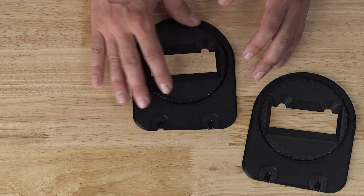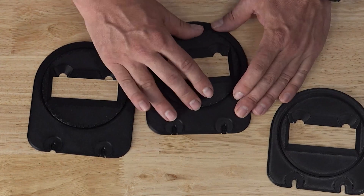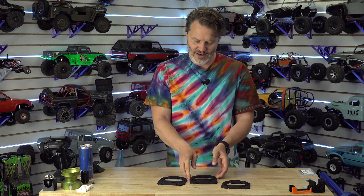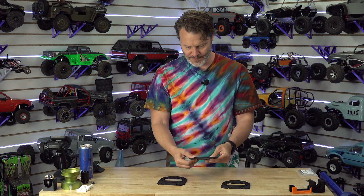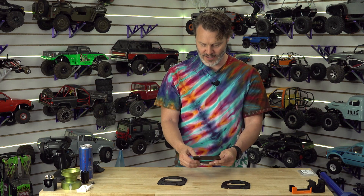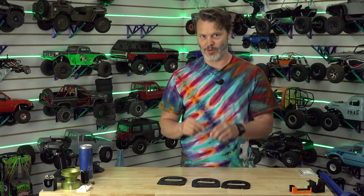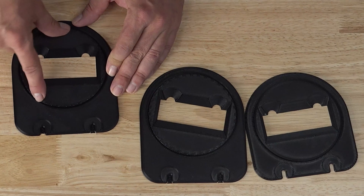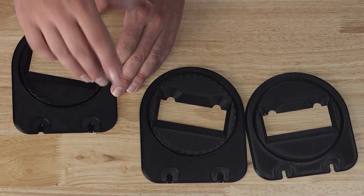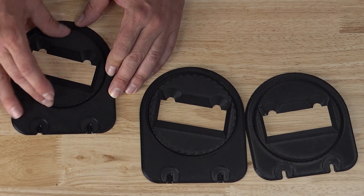They seem to fit real nice, at least, and they're not moving around. The first one didn't quite reach far enough. The second one reaches far enough, but I screwed up my tolerances — there were too many polys in the STL and that messed things up. Actually, I messed up the dimensions myself; I just didn't have everything smart dimensioned in SolidWorks, so it changed one of my dimensions. Then I changed it back and my poly count was way too high. So I moved my poly count back down to where it was on the exterior and interior portions.